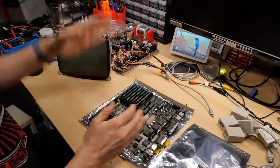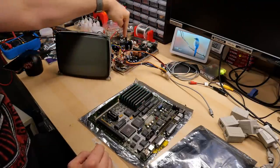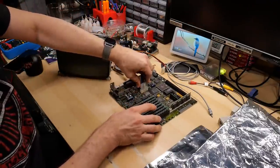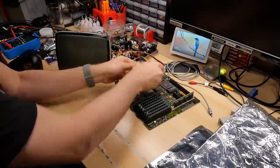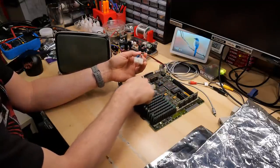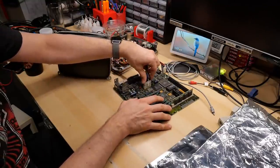What I'm very curious about is this spare Mac Classic monitor and CRT — this is the CRT I rejuvenated. I'm really curious: can I power this SE30 motherboard from this Classic power supply? Taking a quick look, the power supply connector is the same number of pins. Oh, absolutely — it just plugs right in without any issue. Now these types of connectors are keyed in that some pins are round and some are square. So if Apple had changed it, you'd think they would have moved around the round and square holes so that it wouldn't just plug in.